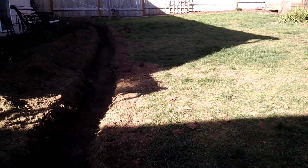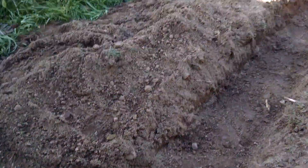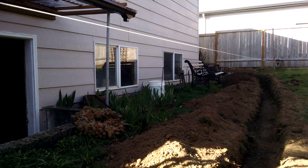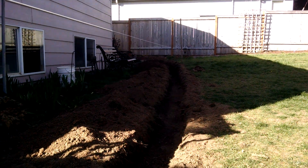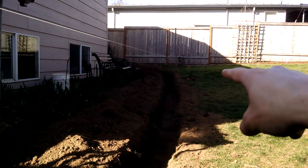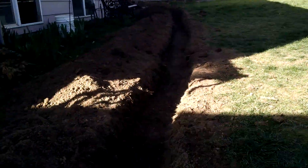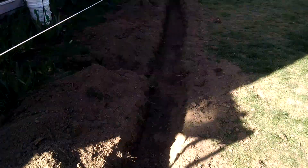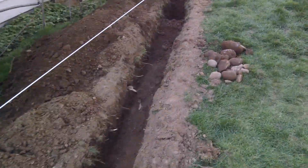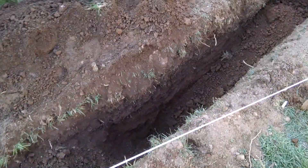It's going to drain out towards the top portion of this trench that we're digging here. The pitch I need to match that line and drop at a rate of about 1.5 to 1 inch per foot is going to get me at about 65 or so inches down there. So it's going to be a heck of a challenge. What we did here was run the rototiller through it about as far down as it would go, then dug that out. We will be renting an excavator for the remaining portion. This yard is just full of rocks — just incredibly rocky and rooty. Really, really painful to do.